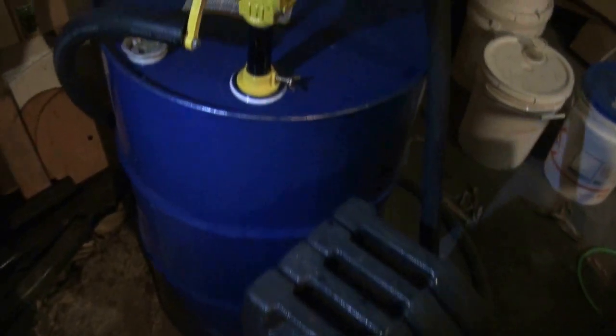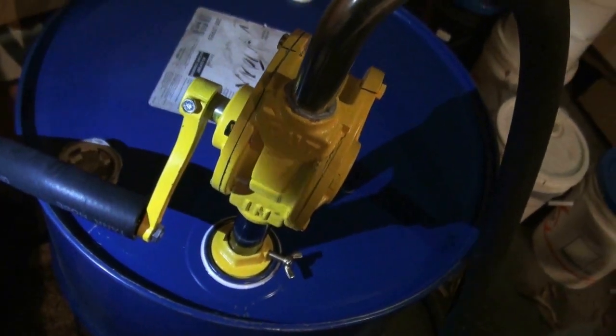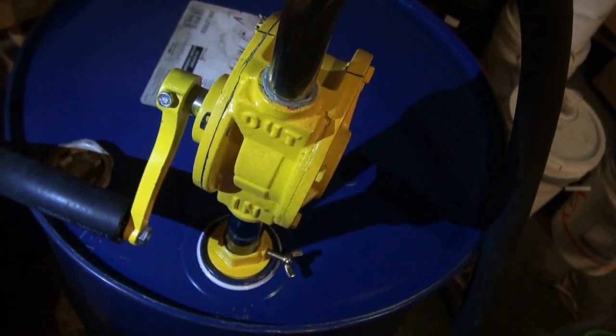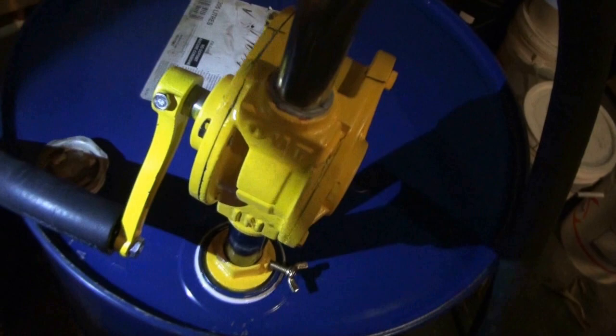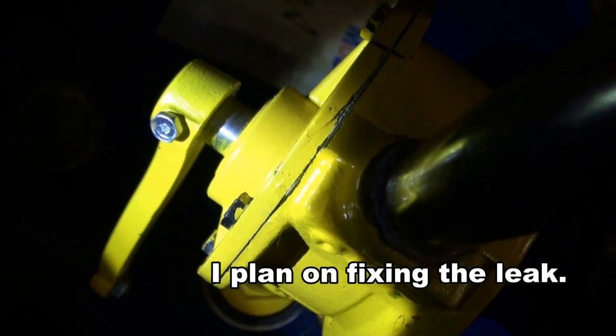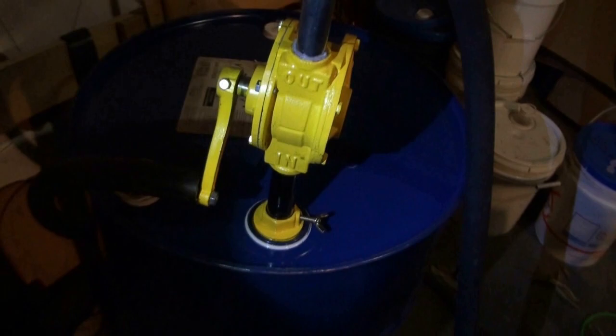I had a chance to try out the pump. I added some fuel to the tractor and also moved fuel from one barrel to another. The pump does self-prime and I think it does move fuel faster than the old pump. However, I've got a leak here at the seal. I think I may have positioned the seal incorrectly in that housing — maybe I moved it a little bit too far and it doesn't ride on the correct part of the shaft. Anyway, thanks for checking that out — more in another video.